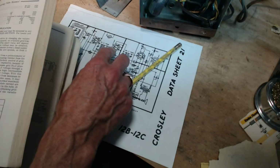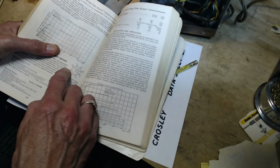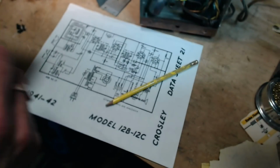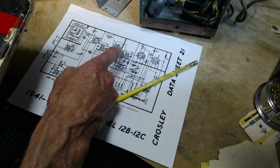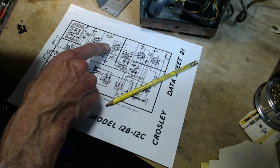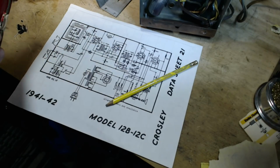So we're talking about 1, 2, 3 says SU. What is 3? Oh, SU, suppressor, of course. Suppressor grounded, that makes sense. And suppressor grounded above the cathode resistor. Makes sense. I think you want the suppressor and cathode the same, I guess. So that's okay.